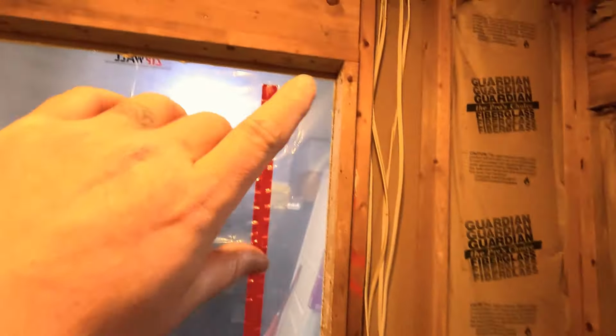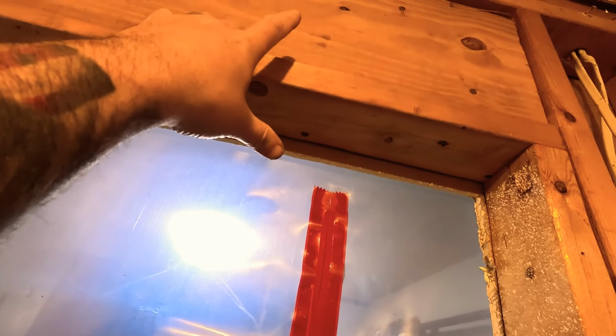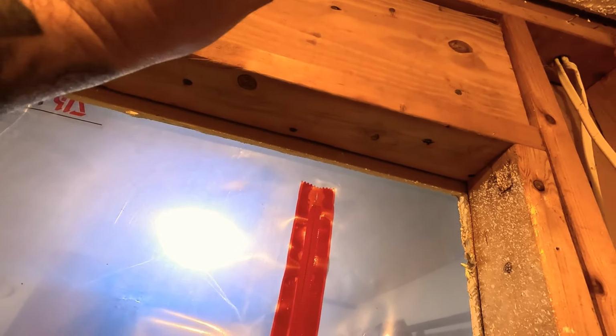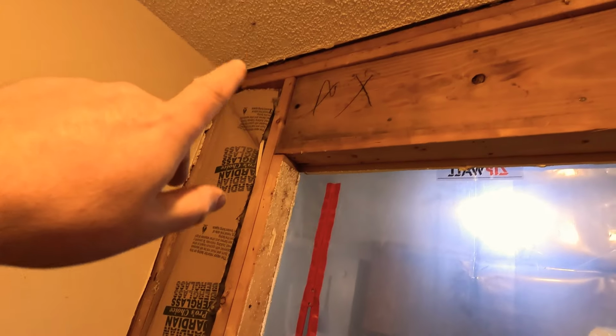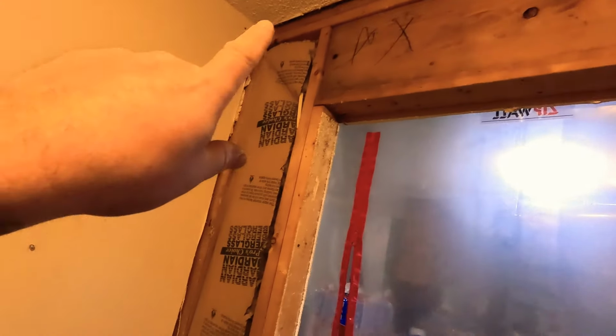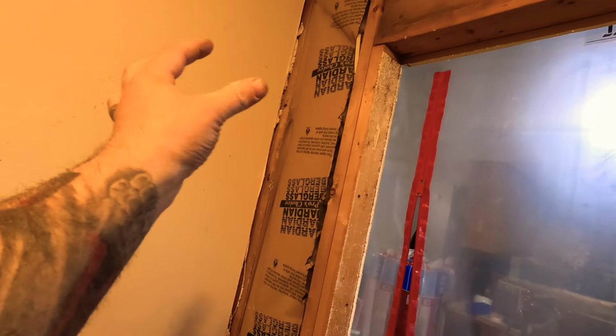Plus when you build these, you need to put a 1/2 inch piece of plywood in between both of the boards. Otherwise you get this gap. So I have to skin something in there, which might be a 1/2 inch. But yeah, there were no nails along there. And the way they did the sheetrock is they ran one to here, one to here. If they didn't butt them, there's a gap.